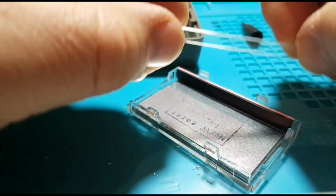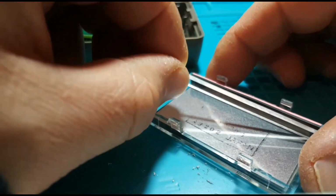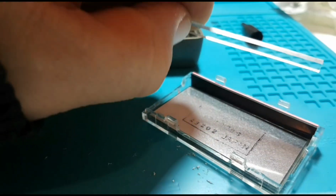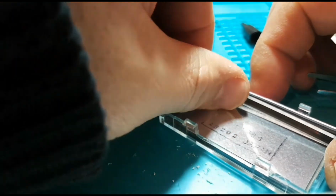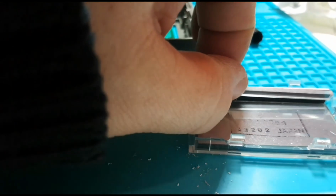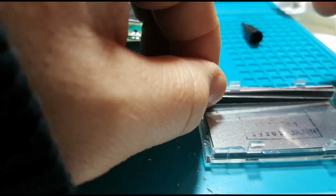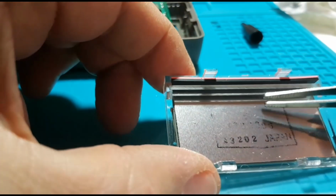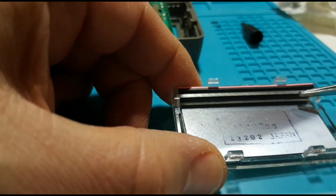This particular meter also had a piece of plastic, and it had come out of the display when I had removed it initially, and that just fits into the crevice. There's a little indentation in the plastic glass panel. Plastic glass, that's a play on words. Anyway, it just slips in there like so, if I can get it. And let's see here. And what that does is just helps to hold the elastomer strip in place, and probably gives it a little bit of pressure as well.